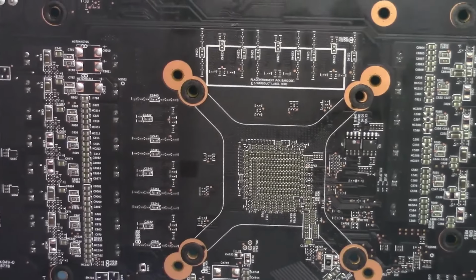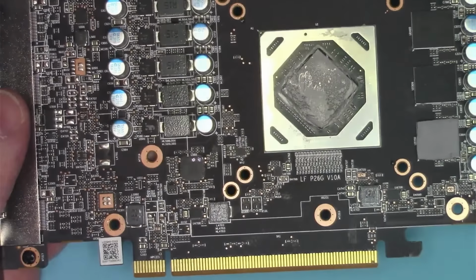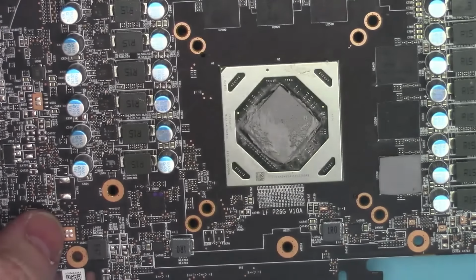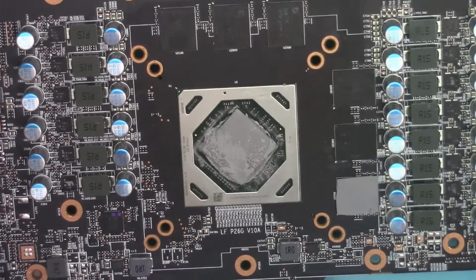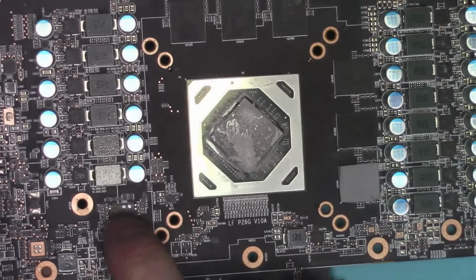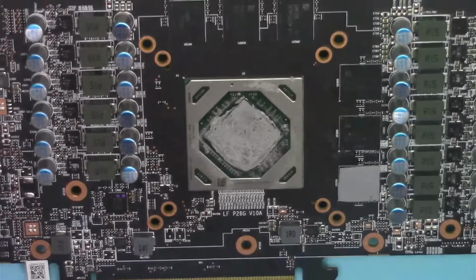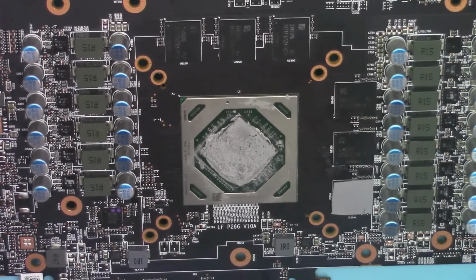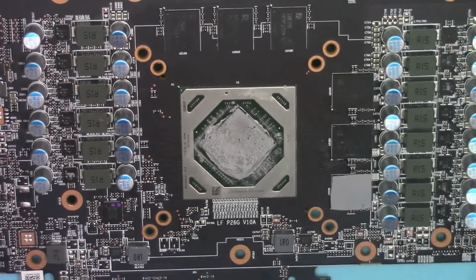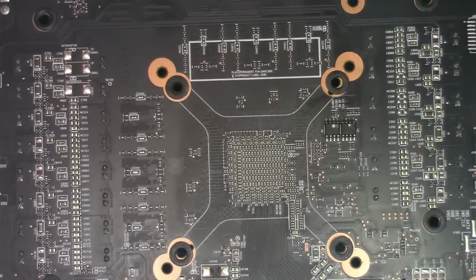So the easiest way to connect to this device would be to look on the board. There are three pins that we have to connect to. So first one is the ground. Then we'll have to connect to SDA and SCL. So in these pins, you can connect directly to the chip. You can just solder them on, but it's very finicky and it's a very delicate place. Generally speaking, you don't want to do that. What you want to do is connect somewhere on the board. And usually there is some sort of a connector.